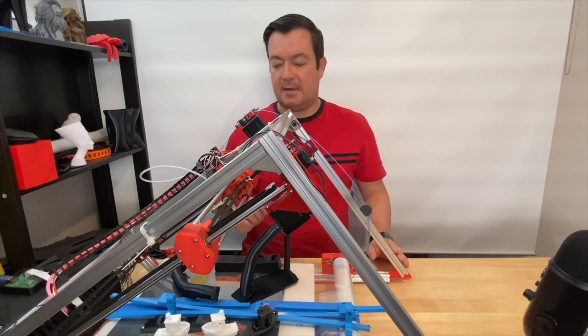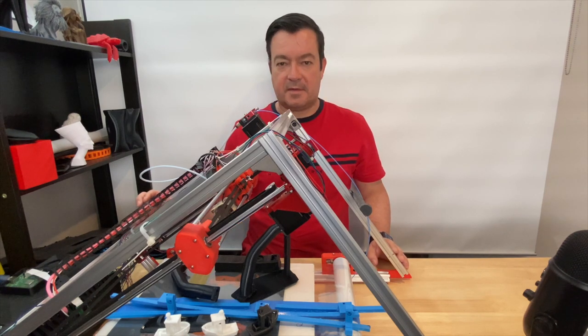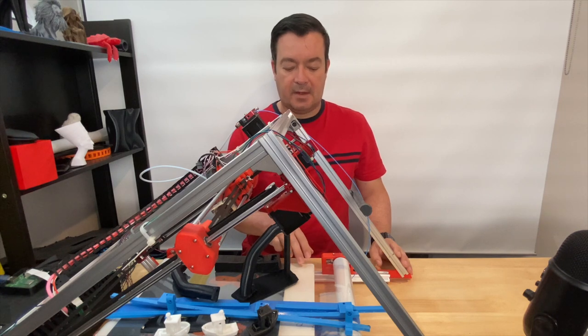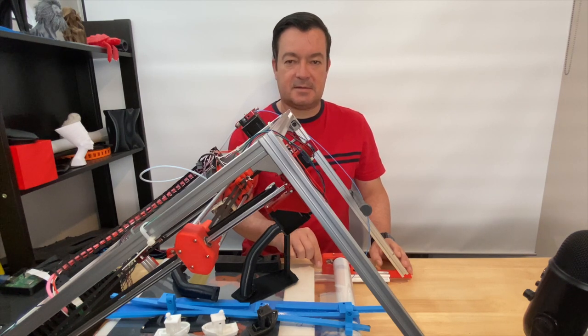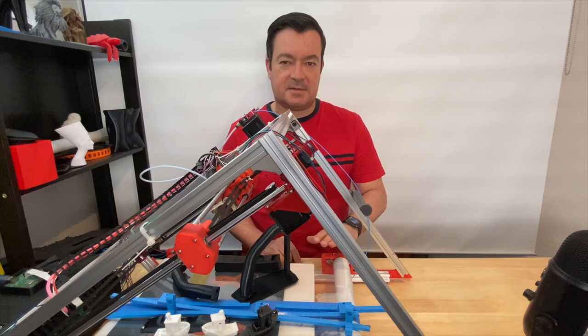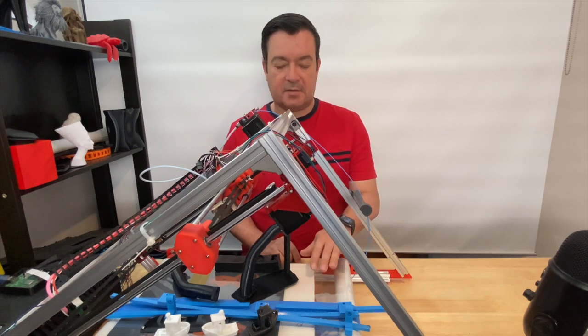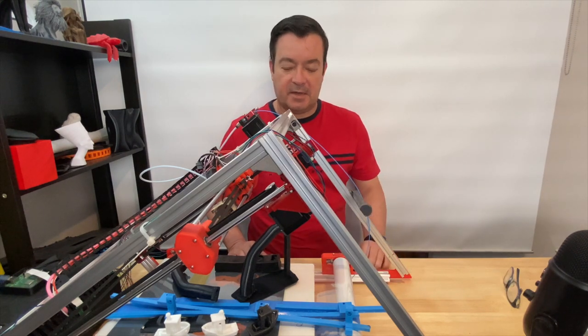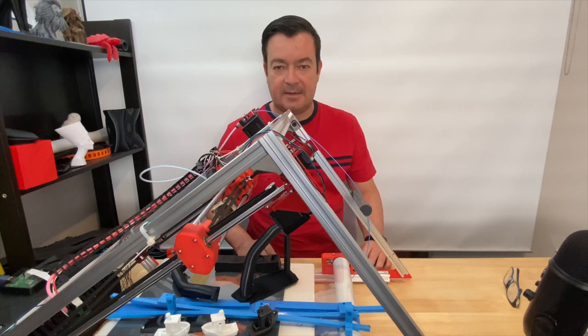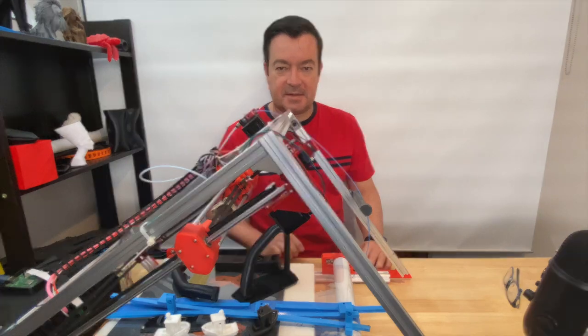You all know that the challenge with a belt printer is the material of the belt. So previously I had stainless steel on here. I didn't quite like it. Sometimes it doesn't stick that well. So I thought I'll try some polyester material. So let's see what damage was done by printing nylon and PLA and ABS at high temperature on this polyester belt.